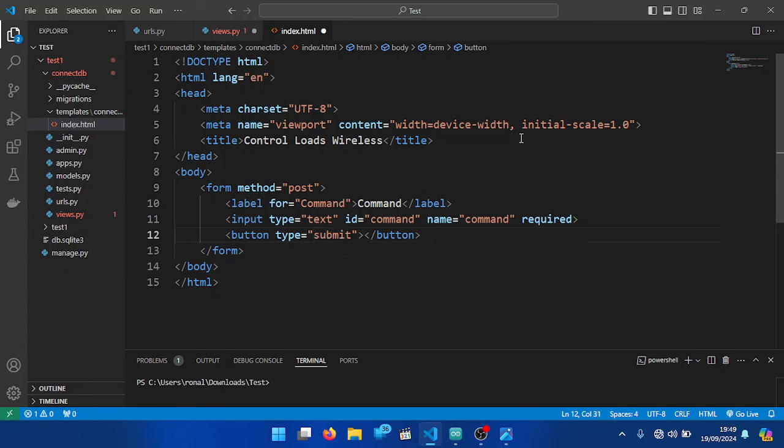You can go to your board manager. Come to Tools, then Boards. We have a board manager here. In board manager, just search ESP8266, then you'll be able to install this board. I already have this board here. You can see this is generic ESP8266. Select the generic board there. After that, now you can start coding.